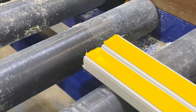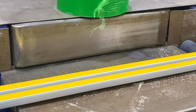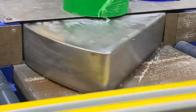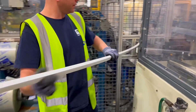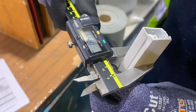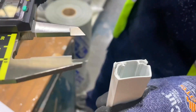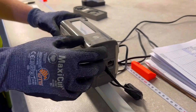This product we're making is our Mini 2 range, probably the most popular — 25 by 16mm. We do a range of sizes from 10 by 8mm to 38 by 38mm. Throughout all of our production processes we quality check the product, so we'll take samples, measure the dimensions, check that we're within spec to the drawing, and then we'll also colour check the product.